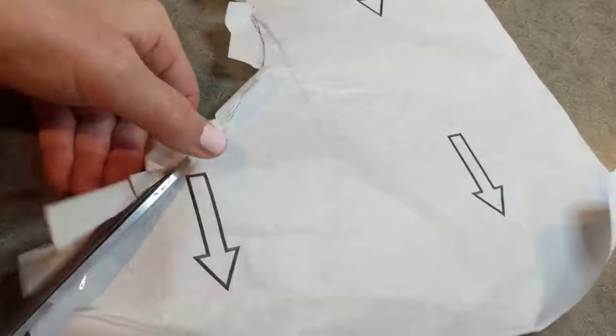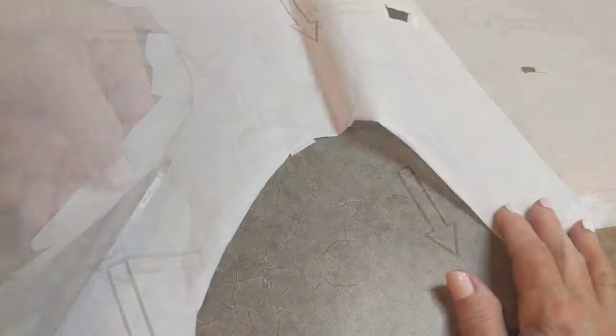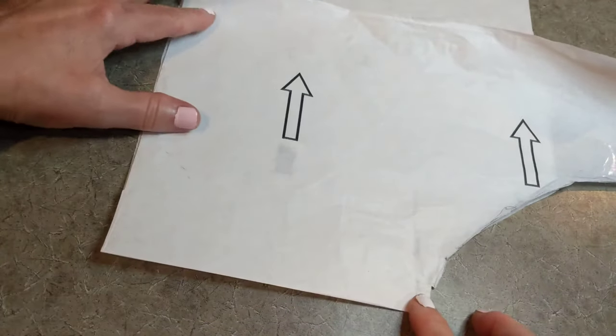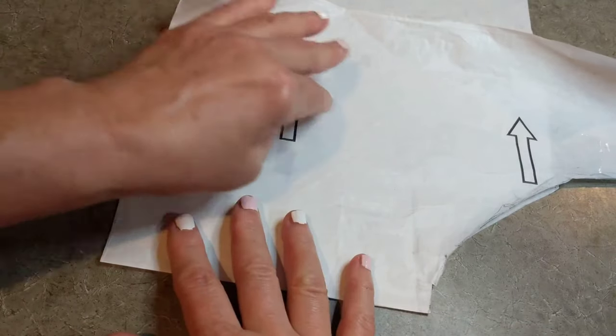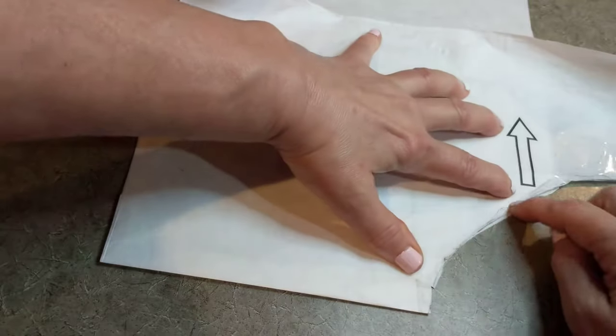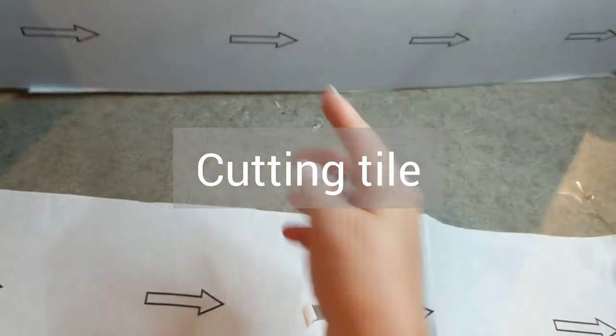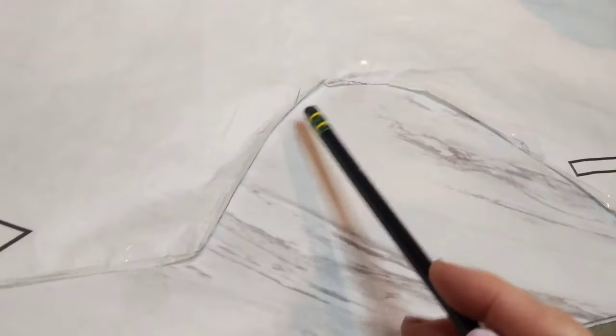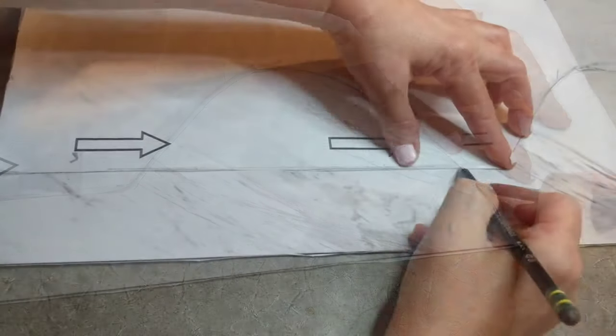For the back of the toilet, once again I'm using the paper and I traced around the toilet. Here I'm folding the paper in half and where the midpoint is, I make sure that both sides are equal. Cutting the tile — make sure it's going in the same direction. I tape the paper to hold it so it doesn't shift while I'm marking the tile.